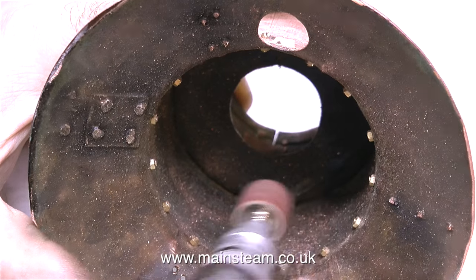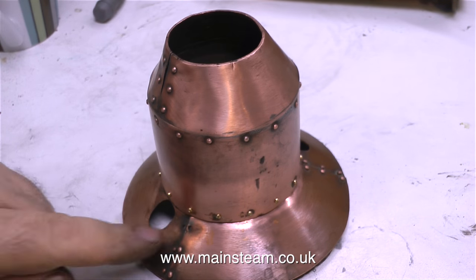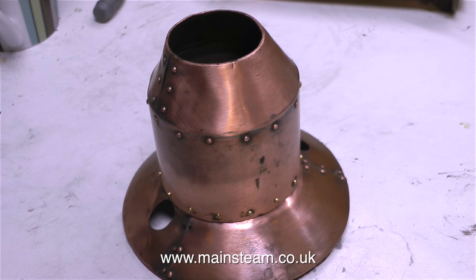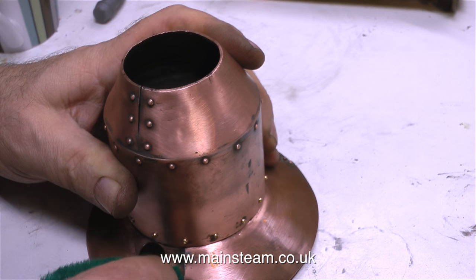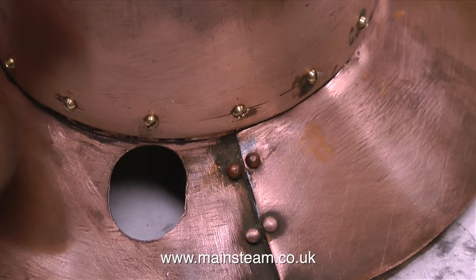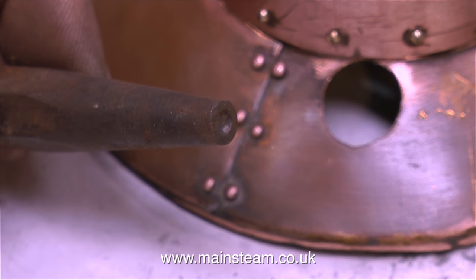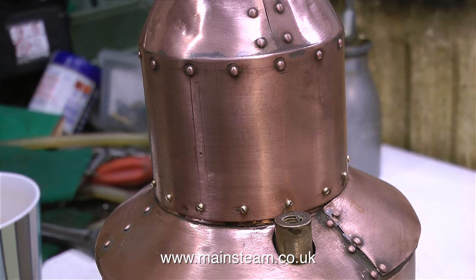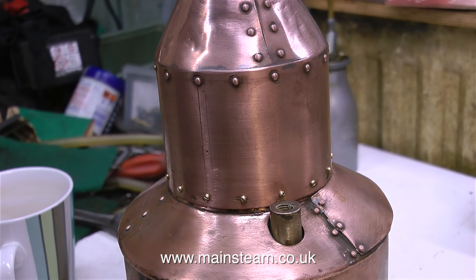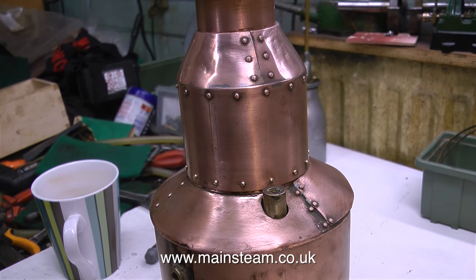Another good reason for this is that I think I'm going to turn the nuts and bolts round so that the nuts are on the outside — I do think they'll look better than the screw heads, because if this was full-sized it would not have screw heads, it would have rivets. Talking about rivets, there are two missing here. As I mentioned earlier, most of the rivets around the vertical tubing section were not really riveted to anything — they were just through the holes. I am going to replace the two missing rivets by cutting them to length and using a rivet snap to keep the front surface of the rivet the same shape, then using my small riveting hammer from behind to expand the rivets in the holes. The more I look at this part, I think it will look better with the 10BA nuts on the outside.